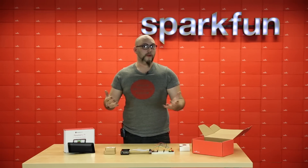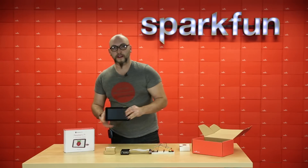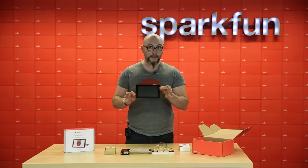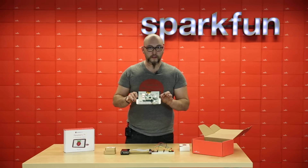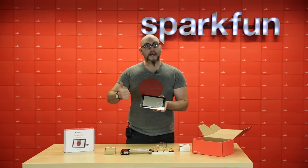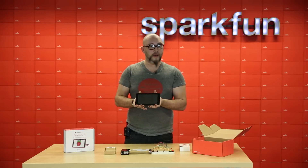We carry a lot of accessories for the Raspberry Pi, and we're always adding to that collection. Case in point, the new 7-inch touchscreen display. This comes directly from Raspberry Pi, and I really like this product. As you can see on the back, the Raspberry Pi mounts directly to the display. It's a 7-inch LCD with touchscreen. You wire this according to the instructions on the site, and then you just boot it up and do an update and upgrade to make sure that all of your drivers are current, and that should load the touchscreen drivers.